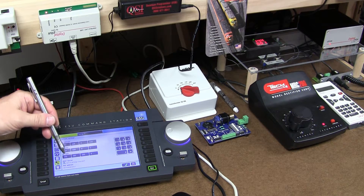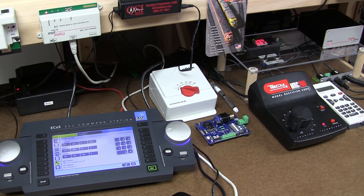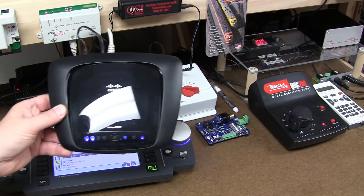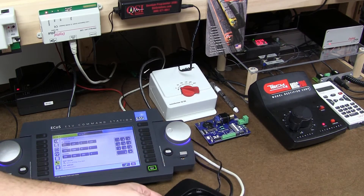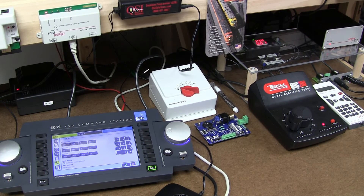If DHCP is not selected, you have to select it, and DHCP must be enabled in your wireless router. If it's brand new from the factory, you're not even worried about it. You just need to rename your network so you will be connecting to that particular network. I'm not using internet in that wireless router, and it's open, so any of my guests can run my trains without any problem with any wireless devices.